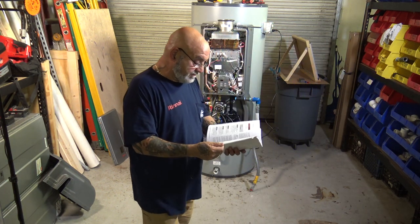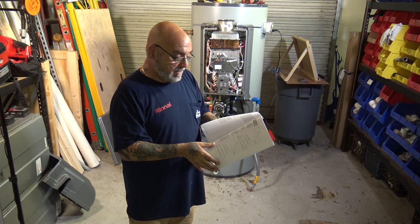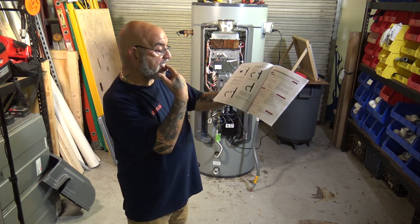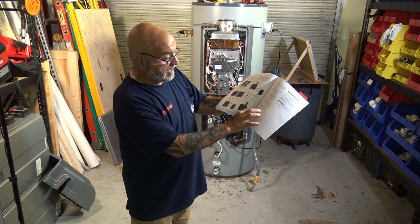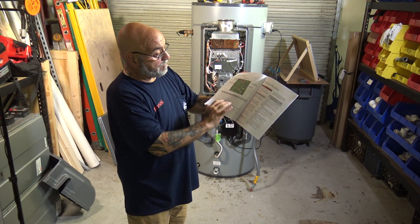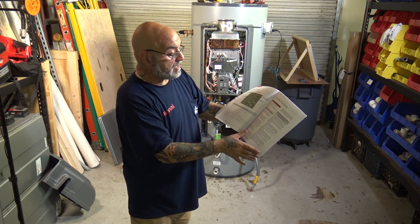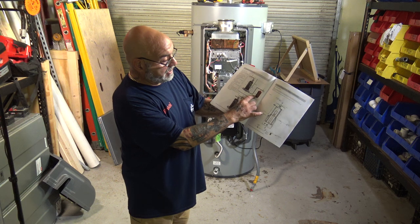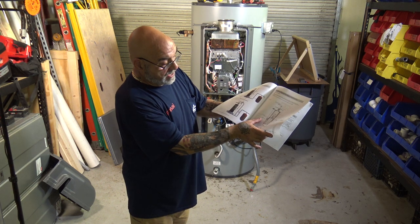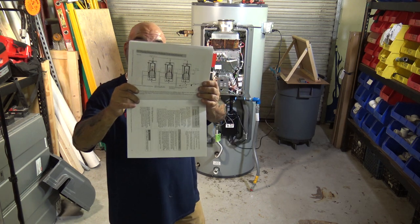The instruction manual gives you the venting, which we're gonna hit on the next video. It gives you room air. Then it shows you the gas connector, startup procedure with the gas, altitude, your wiring with the outlet. Okay, you have your control diagnostics, your system plumbing. They give you, you see, standard two pipe, then with a mixing valve. Again, do not pipe the two relief valves together into a drain, separate, and then multiple unit.